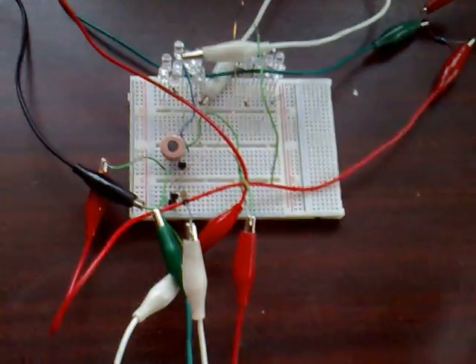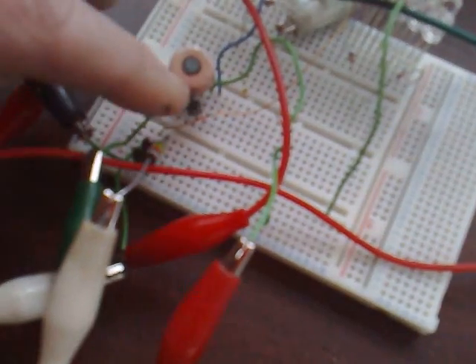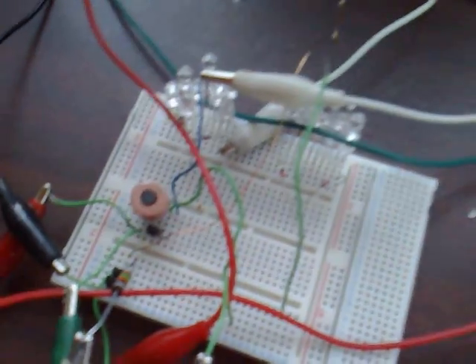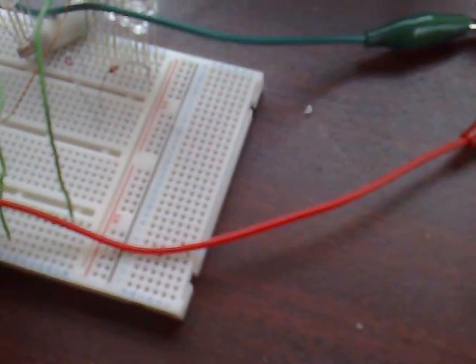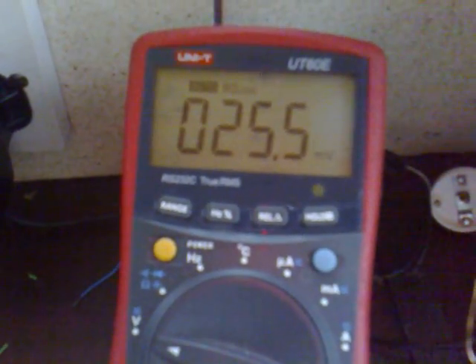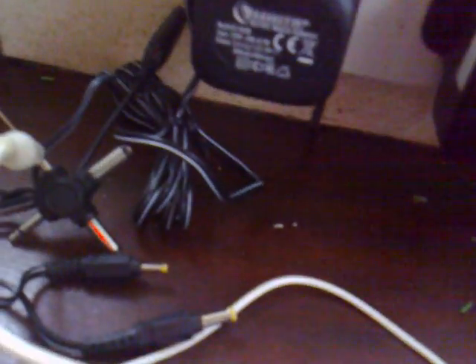This is the circuit I'm using today with the standard transistor, and it's drawing 60mA. This is the SimpleSEC circuit I'm using today. Now I'll just add another transistor in like I showed you on the diagram. The current consumption has now come down to 25mA.